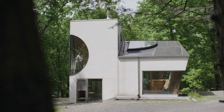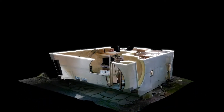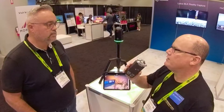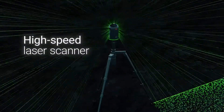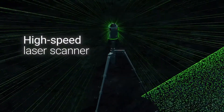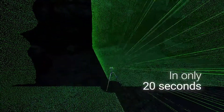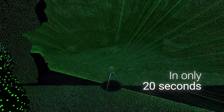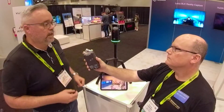Basically, this is going to throw essentially a sphere of laser beams out into the world, and it's going to measure how long it takes for them to reflect back — or it's going to measure the reflections. And from that, we can ultimately get a picture of all the distances of any objects from where that's positioned. Exactly. It does it at a speed of 680,000 per second, so you're getting a lot of lasers very quickly returning back and creating what we call a point cloud, which places all of the objects where a reflection came back to the scanner itself.